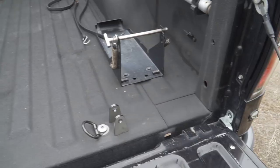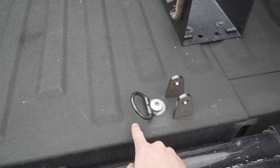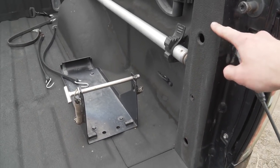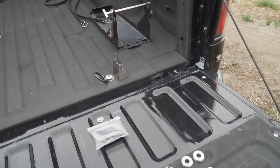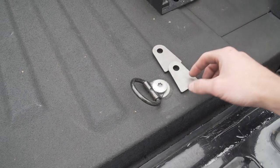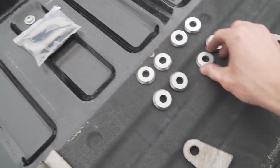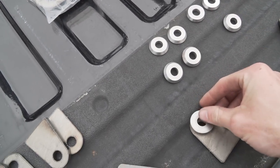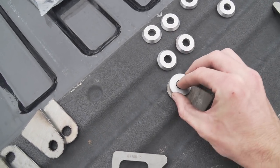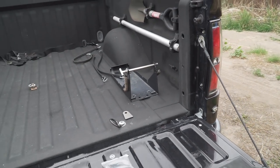The first step is going to be cutting out the 3-inch by 3/16 pieces. I know from this point here to the edge of the bed to about here is roughly 16 inches, and it's also 16 inches from here up to where I want to land up here. So I need to cut 4 of those pieces out, and then I'll start making the little stub pieces that go in between here for the inch-and-a-quarter tubing. I'm going to use these weld washers to cap the tabs off, and they'll sit in between the tabs just like that for a nice perfect fit.